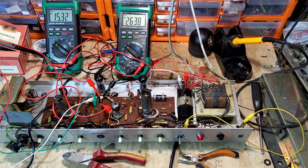15.3 divided by 180 equals 85 milliamps, divided by 2 is 42.5. Take away 5% for the screen gives 40 milliamps. Times 299 volts - that gives us 12 watts on the nose. At 237 volts on the variac, the screen is at 263.7 volts - so we're 13.8 volts over on the screen. I think I'm going to risk that. So: 180 ohm cathode resistor, 2.2k first-node-to-second-node dropping resistor.